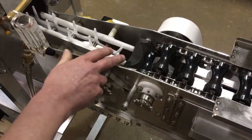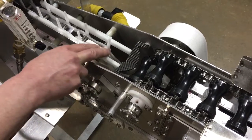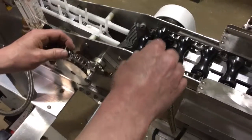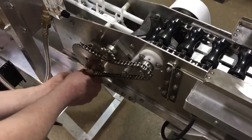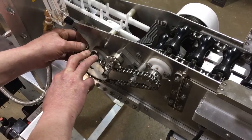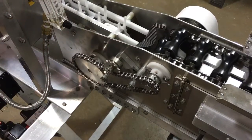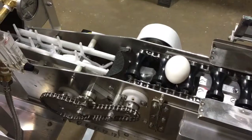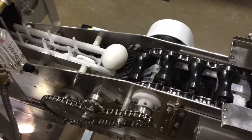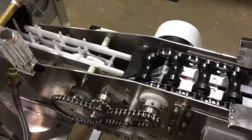So we have this transfer at a slight slope, we have the plastic triangle in position, so now we'll look at the timing between the two chains. We'll put this back on and turn the machine on. As you can see, our timing still needs to be worked on — the egg is hitting the fingers, so it's not even rolling all the way across.